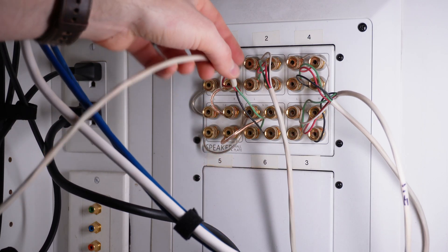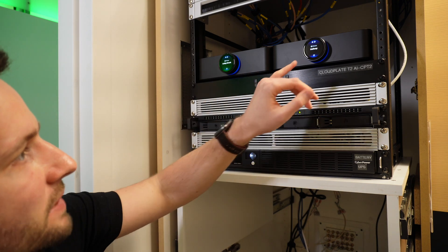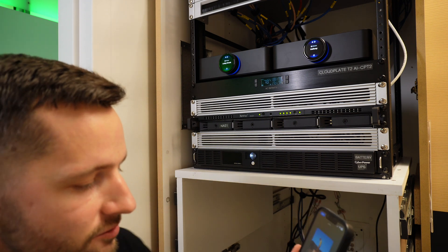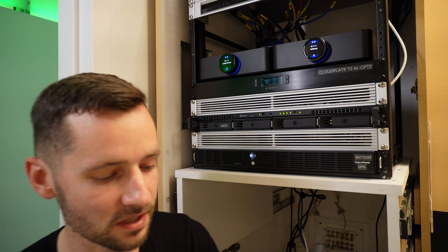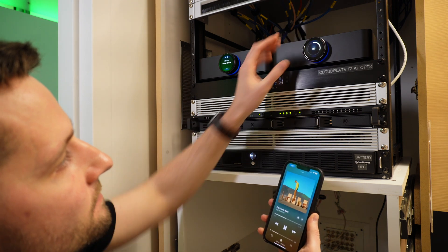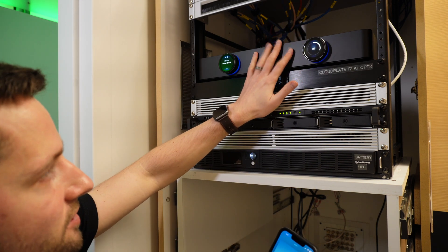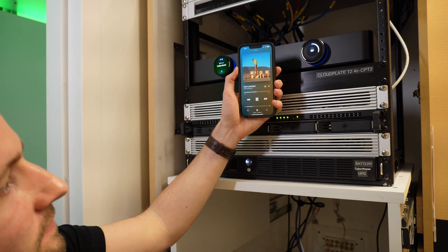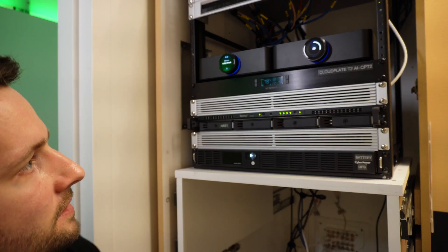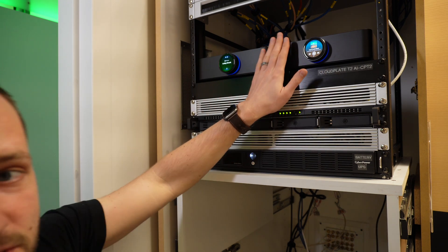The speaker wiring is done. The second power amp is set up exactly the same way with speaker wire run the same way. Now we have lobby plus break room and the hallway. I'm playing a reference song via AirPlay from my phone and have already dialed it in. At volume 30 it's roughly at the previous 50 decibels — that's about 30 percent without any power amp adjustments yet. Walking around, I can adjust phone volume as well. This one was set at about 37, so one is a little quieter and one is louder.